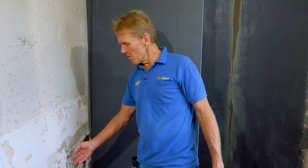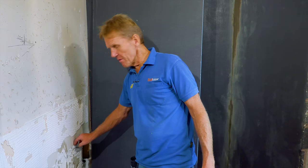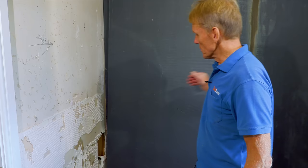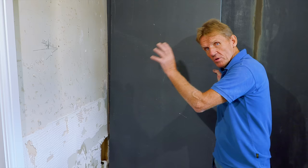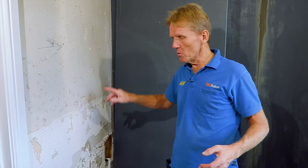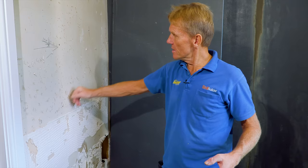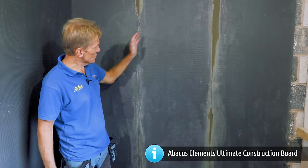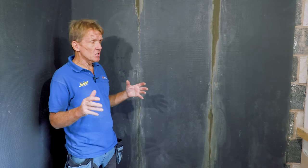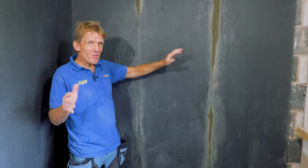Here's a familiar scenario - you take the tiles off the wall and half the wall comes with it. You could rip all the plasterboard off and put elements board straight onto the stud wall, which is absolutely fine. But the 1700mm tray left us a little bit to make up on this wall, so I'm putting the elements board on the end of the wall, screwing it straight over the top of the plasterboard. I know where the studs are, so fixing points are easy to find. I've also dabbed it with KST adhesive - a really good non-shrink tile adhesive - and it's giving excellent adhesion.